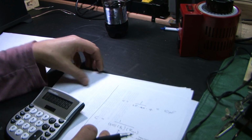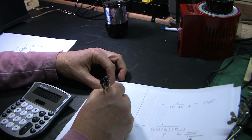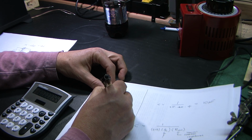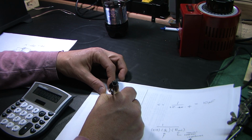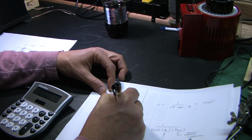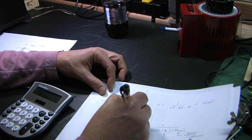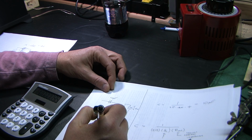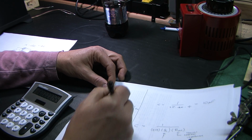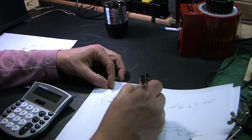So with 10, again, if things work out with 10 microfarads, with the L pad hooked up, eight ohm speaker, 8 ohm L pad, at 4K, the XC. Now we know that this whole mess right here is going to be 4 ohms right there.